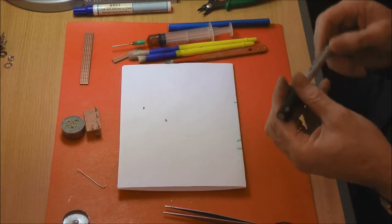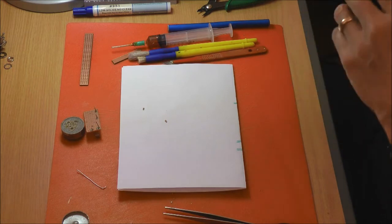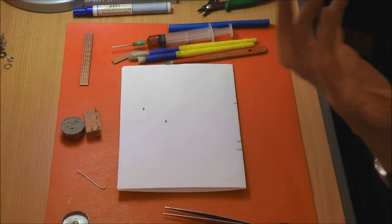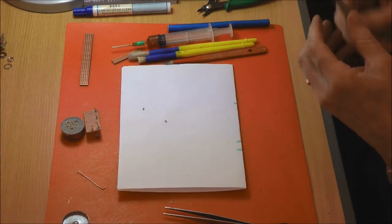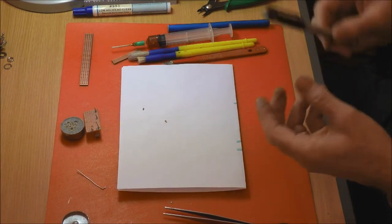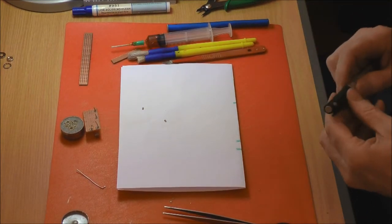Yeah, I've used the etch resist pens, but typically you're trying to do something fairly fine, and just as you get to a critical point, it goes blob. And to wipe it off, you can't take everything else off with it. The toner method's very good, very reliable. You can do quite fine traces if you're American, tracks if you're English.